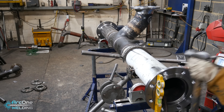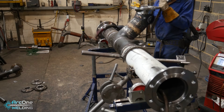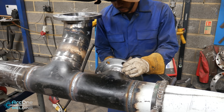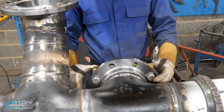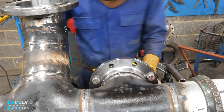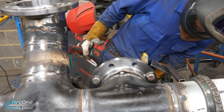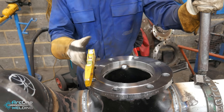And that is the technique I use to hang my flanges. The next step is to flip it 90 degrees and level the face of the flange to the long lengths of the pipe. If one of them is a bit off, just split the difference. The fittings are so thick that to hit the measurements the drawings want, you have to shave down either the flange or the T — in this case it was easier to take material off the flange. Simple: tack on the top, make sure the face of the flange is good, tack the bottom, flip it 90 degrees, and then level that off to the existing flanges rather than the pipe.